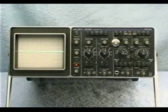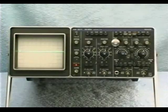The front panel of an oscilloscope appears to be a very intimidating instrument to operate. Starting from the left, we have the main oscilloscope screen, which consists of a cathode ray tube in the case of an analog scope, various beam controls, as well as power controls. The oscilloscope featured in this training video is a dual trace model; therefore it has two vertical input channels — channel A and channel B. The ability to display two signals simultaneously is met with ease. There are a multitude of controls, knobs, and switches necessary to properly display a signal on the graticule. We'll concentrate on some of the basic functions first, working into more advanced aspects of the oscilloscope later in the tape.